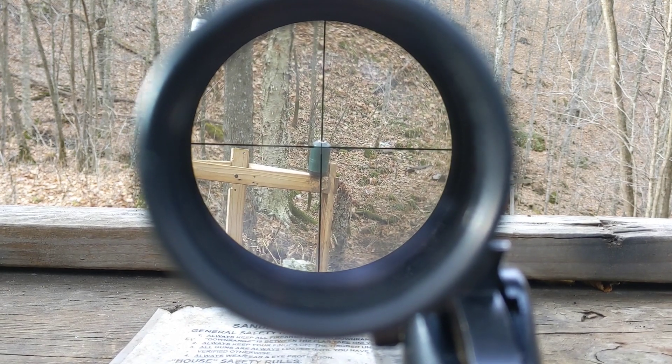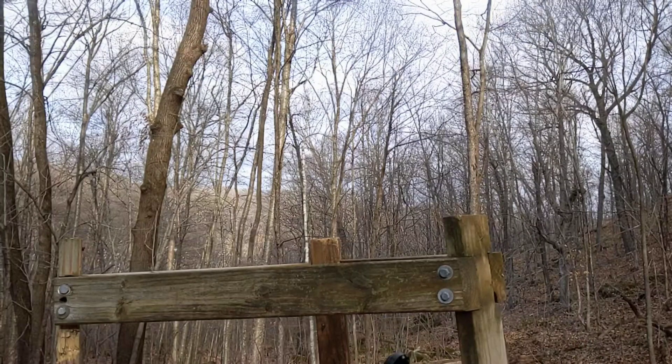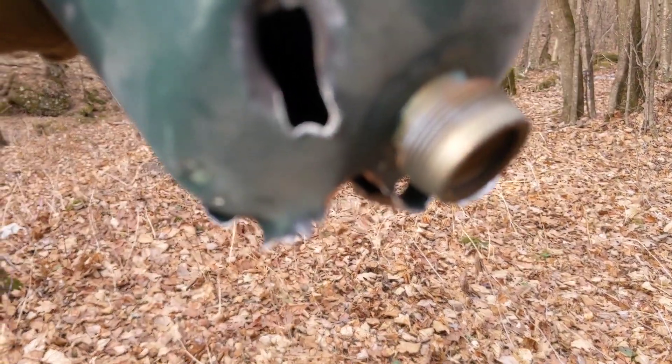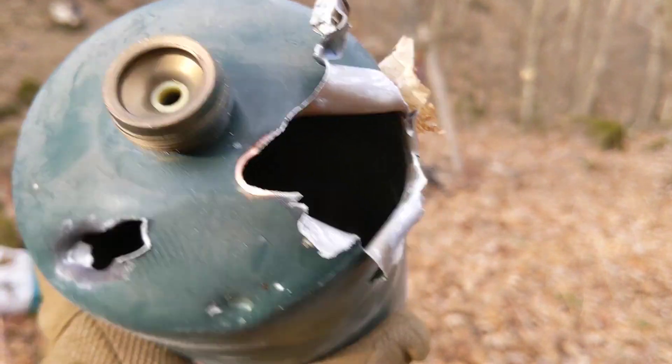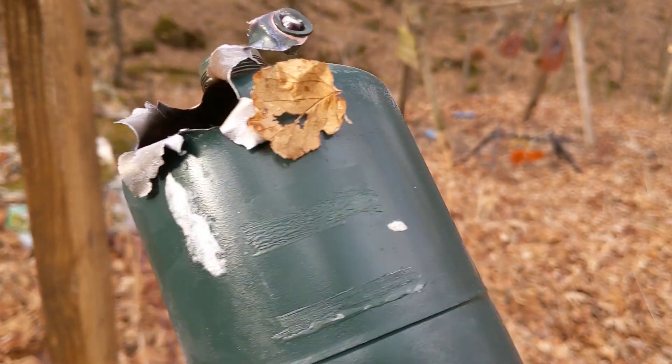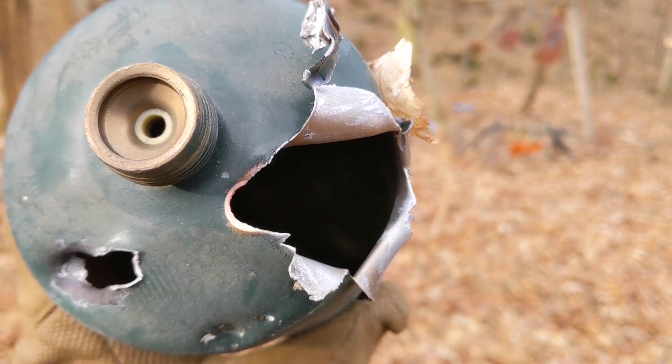Since my coffee can crucible did not make the cut, I'm gonna use this propane cylinder. It's a little stronger and thicker steel, but I'm not a hundred percent convinced it's completely empty. So before I go taking a hacksaw or a sawzall to it, I don't want a jet of flame to come out or this thing to go blasting across the room, so I need a safe and preferably distant way to make a hole in this. That one actually had a little more juice in it — you can see it pouring out. It sounded empty when I shook it but obviously had a little pressure left because that exit hole is much bigger. I think I can still use it by cutting it off below that exit hole, so we should be okay for a crucible.